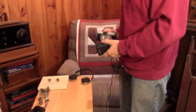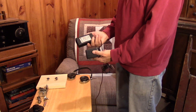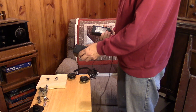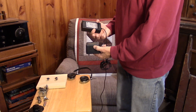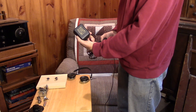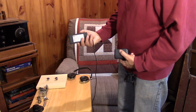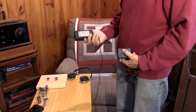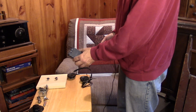Let's talk about power for this set. There are many wall warts and DC supplies out there — some with IEC connectors giving 24 volts DC. I think we need to use the old fashioned transformer-rectifier style wall wart, not a switching type supply, which puts noise into the circuit and potentially injects high frequency interference into the regen stage. So let's avoid switchers and look for 24 volt linear wall warts.